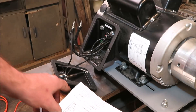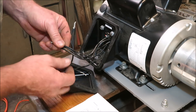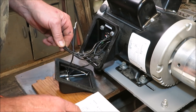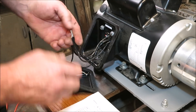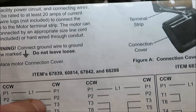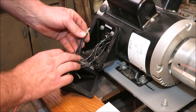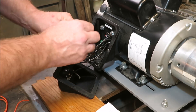So what I'll do is I'll come up to these wires up here, which I've already done. If you look on the side, you've got T8, T2, and T4 identified there. Now on the other side over here, we're going to wire these together — that'll be P2, T3, and T5. And that's what I've done here: I got those three wires P2, T3, and T5 wired up on there.